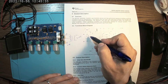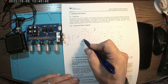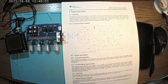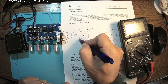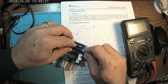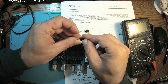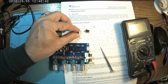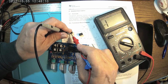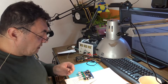Here's the NE5532 schematic. At the input we have two transistors in opposite complementary configuration — an NPN and a PNP. Checking the input in diode mode, our tester between pins 2 and 3 should give a very clear diode indication in both ways. I'm checking this because I have to know if these chips are original or fakes. I'm pretty sure they are fakes. We have pins 1, 2, and 3 — these two should give me some diode numbers, and nothing, as you can see. So these are fakes. That doesn't affect functionality — I'm pretty sure it will work.